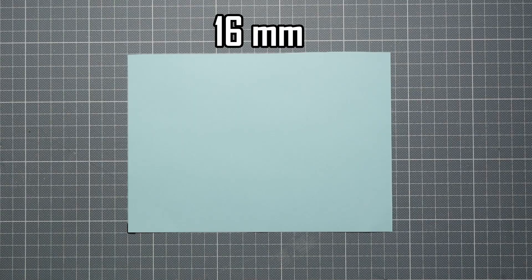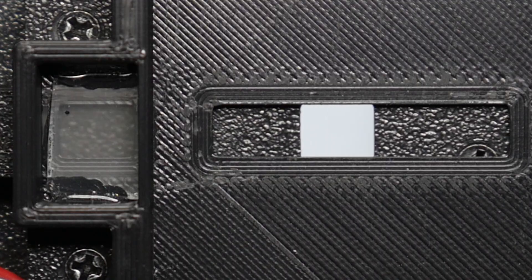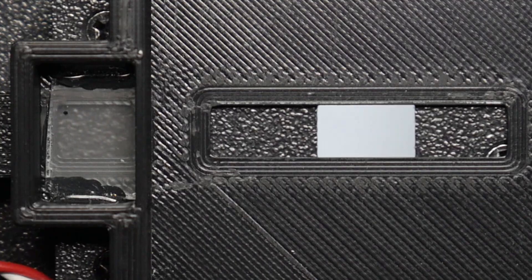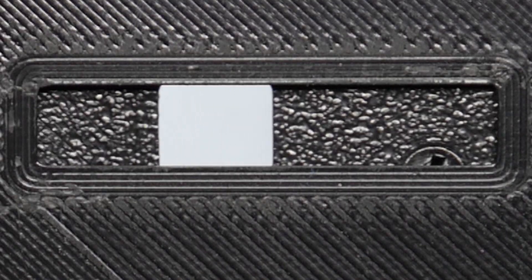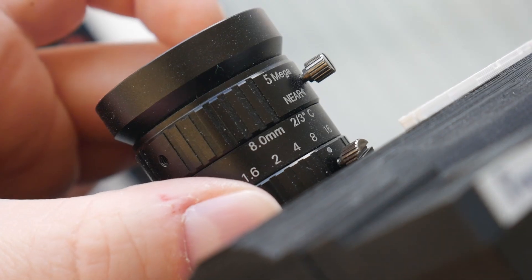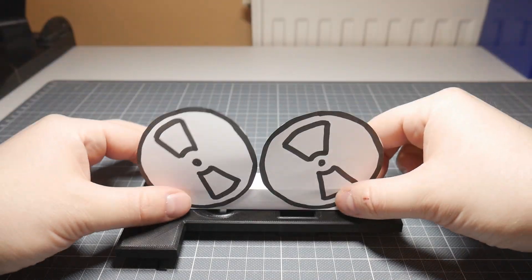One could say that the 16x9 gate size lays somewhere between 8 and 16mm formats. Nice! But there's a catch. Note that the 4x3 gate size uses four long exposure tracks from edge to edge, and the 16x9 uses only three long tracks, meaning when shooting with 16x9 gate size we lose one quarter of shooting time. But in return we get a wider format with increased resolution and smaller grain size. So the 4x3 is used for longer shots and 16x9 for shorter but wider shots.